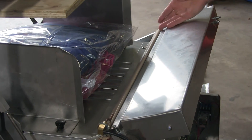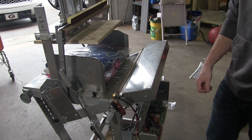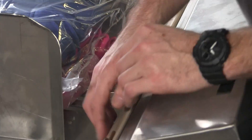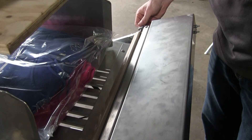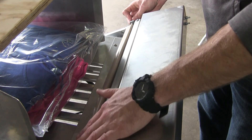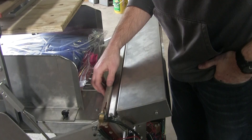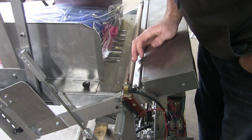Next I'm going to go over Teflon and the wires — a couple things I want you to keep on your shelves for basic operation and preventative maintenance. This is Teflon. As you can see, there's a lot of it hanging down here with a weight on the bottom. Over time it will turn black because you keep sealing on it. Once that happens, move this up a little bit and get a new sheet — easy as that. It's inexpensive, about $55 to keep on the shelf. Always have flat and round wire on hand as well — you never know what's going to happen.